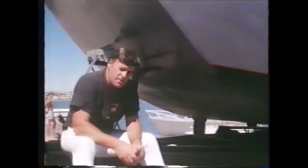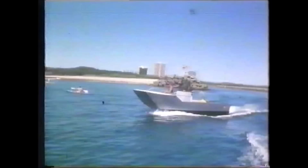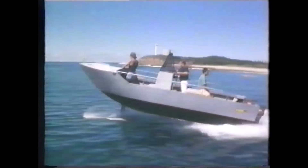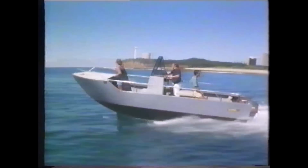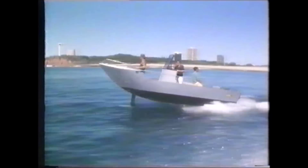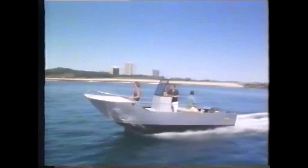Welcome aboard. Pat Jones of the Sunshine Coast has come up with an idea which has an enormous amount of merit. It's called an ultrafoil — designed to be a fully submerged foil and to control the bow of the boat as she comes over a wave. Up until now, boat designers have concentrated on trying to handle what you can see on the surface. But Pat Jones went a little further — he reasoned that waves don't go very deep, and if he could have a force acting on the boat originating well below the surface, the effect of the waves would be minimised.